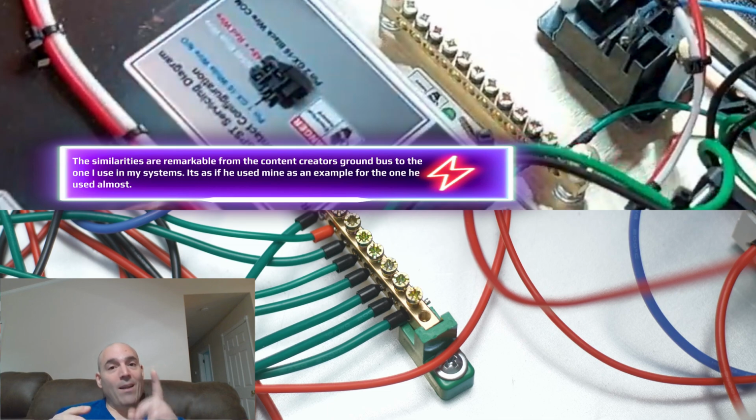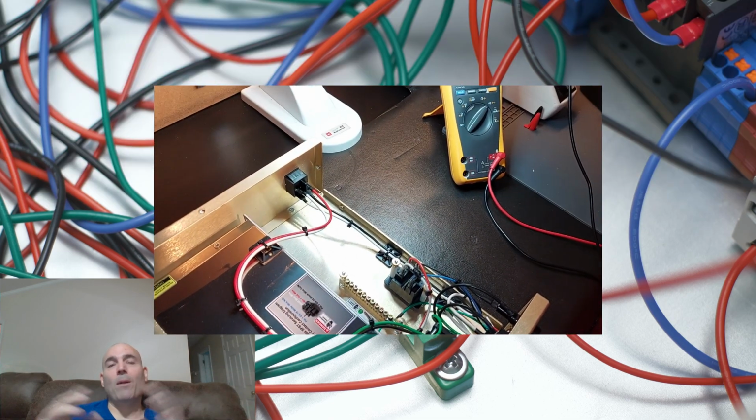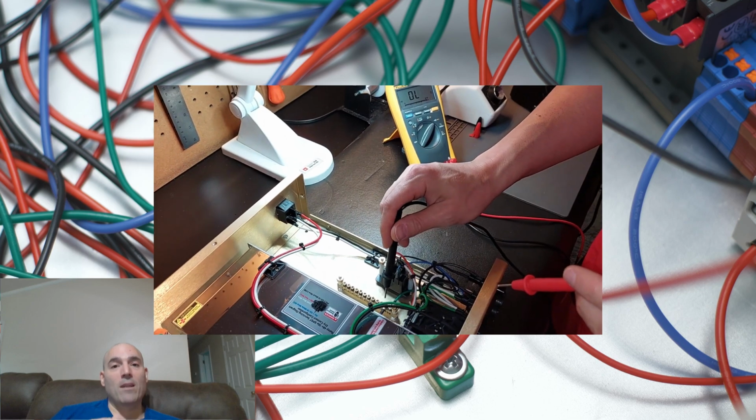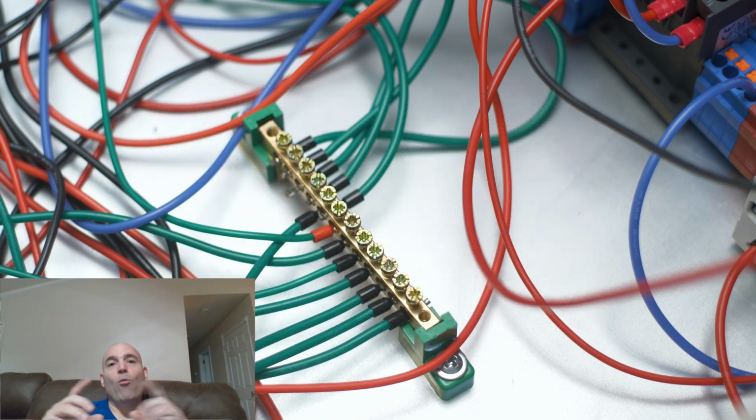ground procedure. Now, the other thing to keep in mind is this, and I've said this in a previous video last week. When you are grounding, any type of coating that's on your chassis or any object that you're planning on grounding must be removed in order to allow for proper conduction. And once again, grounding is only truly achieved for robotics use when and only when you have a resistance of 3 or under on your ohms reading. Now again, the novice here did not pick that up.